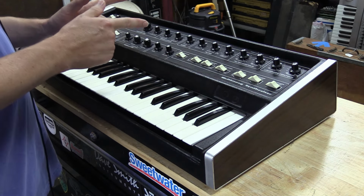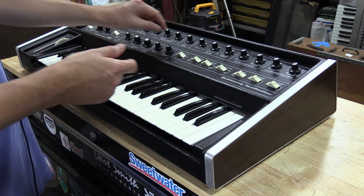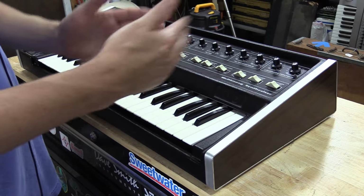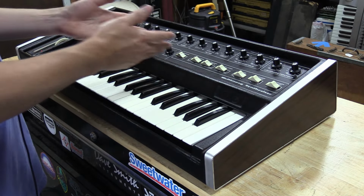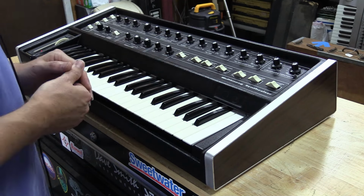So the first thing that makes it unique is it's actually linked to the octave footage switch of the oscillators. So most filters, once you tune them up, it's kind of fixed in a frequency, and you have to use your cutoff to reset the next frequency or step up in frequency or down in frequency in an octave, so to speak. Not in this. You set your frequency and then you can actually switch your footage and it changes the octaves of your filter. So that's really unique.